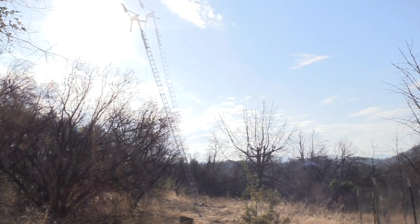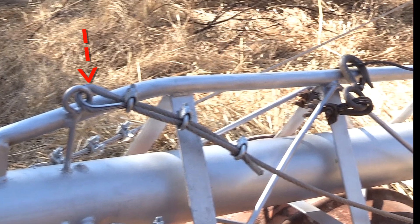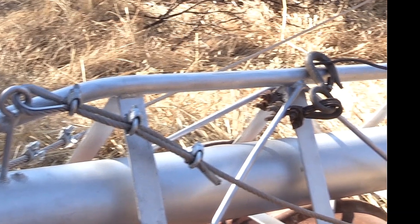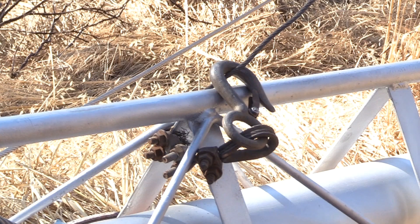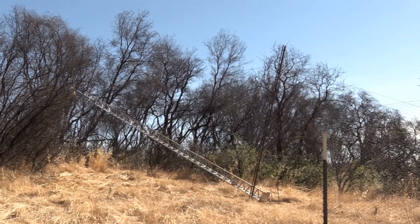The next thing to do is get this tower down so I can do the surgery on those upper anchor eye bolts. You might be wondering how I'm connecting the winch cable to this if I think the eye bolt's not strong enough. Well, I went down a little lower on the tower and connected the winch cable directly to a nice strong spot. But the problem is that each and every time I want to lower this tower, I've got to climb up to physically install the winch cable, and again when I raise it back up. It's a thrill, but I'm getting older and don't want to go up there if I don't have to.